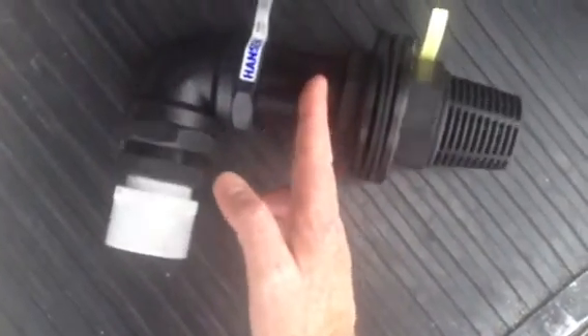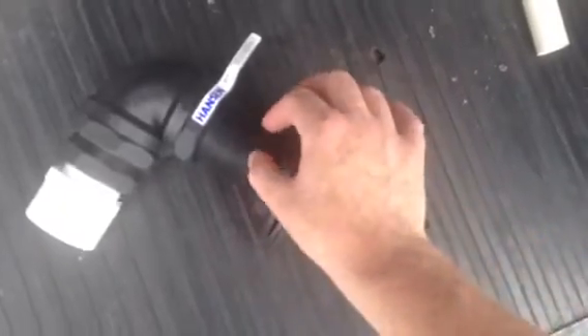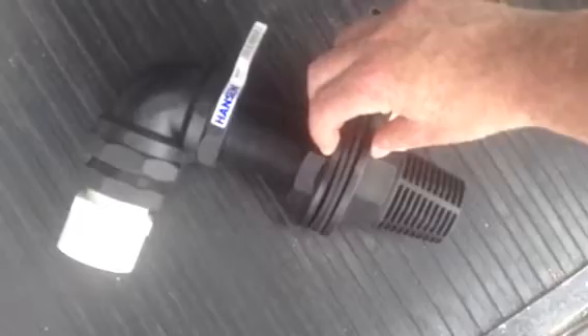The next thing I'm going to do is cut this about here — cut it between the thread, just so there's enough thread to thread that on. When you do these threads, make sure you use plumber's tape and put it around reverse to what the thread is. Once you've plumber's taped that and stuck it on, and cut off enough to give enough thread, then that goes down.